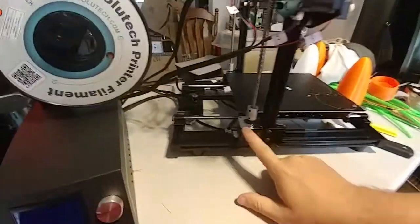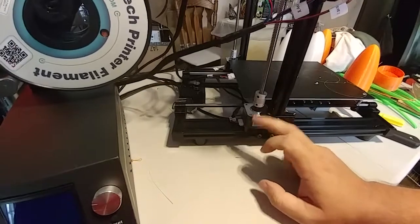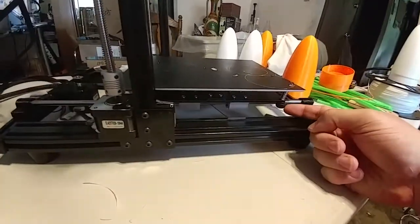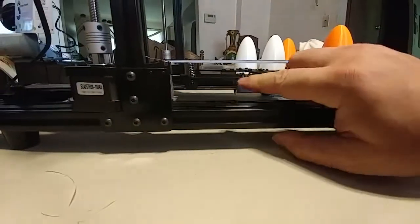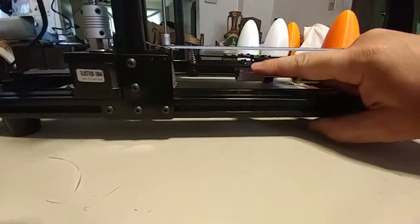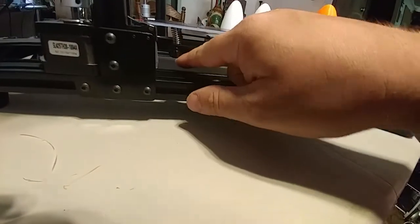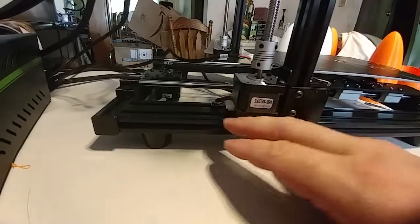First things first, these motors need to be rotated 90 degrees so the plugs come out the back. The problem is the tolerance between the space between this plug and these knobs in the back — this is very tight, and so far most of the printers have come with this H-brace bent downward. This gets pushed on enough to bend it, and that causes this to collide with the plug. Rotating this 90 degrees makes that irrelevant.